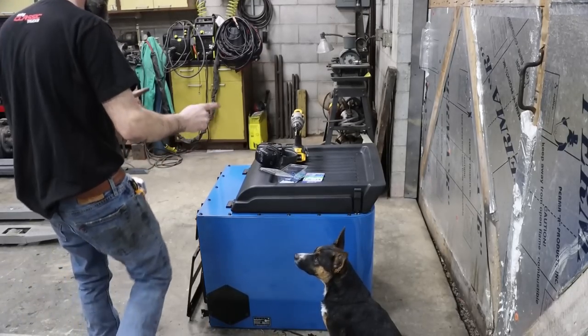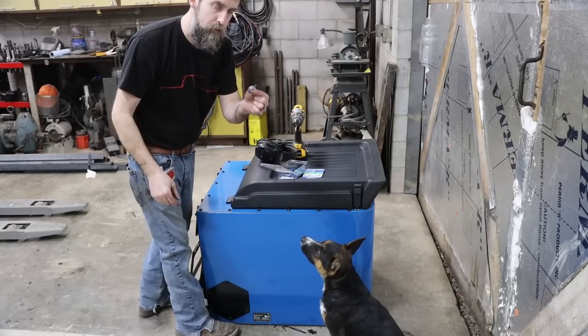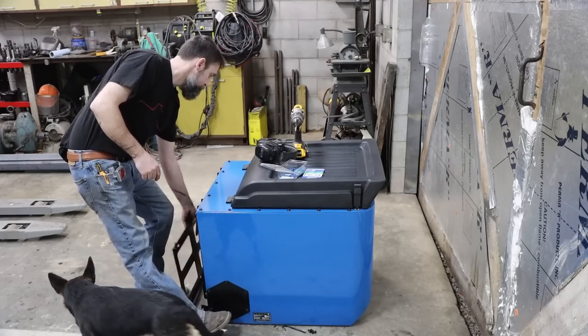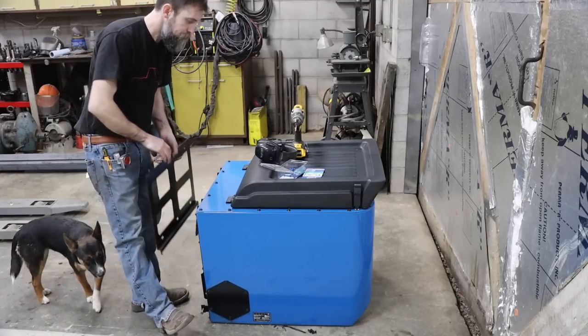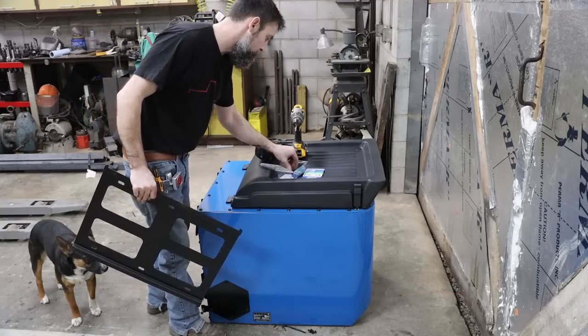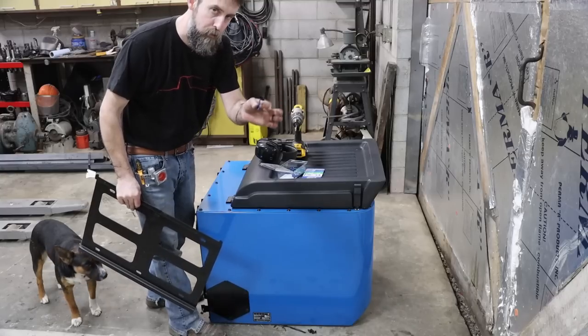So to mount this thing up on the wall, I'm gonna be using these 1/4 inch by 1 1/4 inch Tapcon concrete anchors. Now the bracket looks like this. It's got 3 on the top, 3 on the bottom, and it fastens to the back. So the pull strength on these, if in hollow block embedded 1 inch, is 500 pounds per screw.